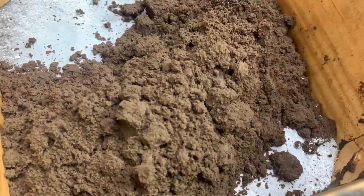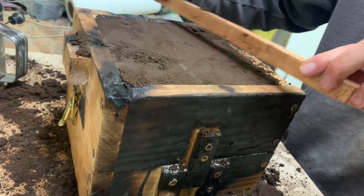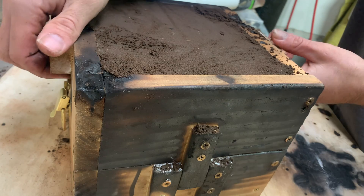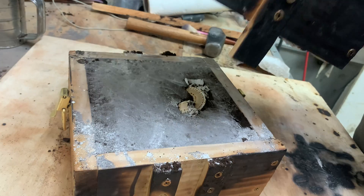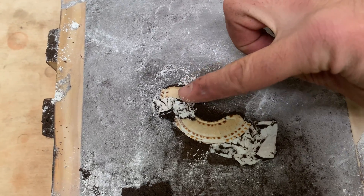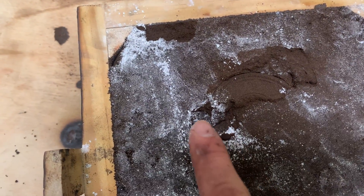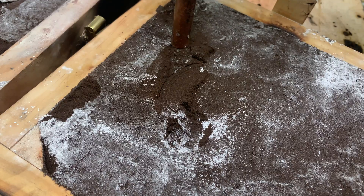Think of it like hydraulics. When you're pouring metal there's a hydraulic pressure effect, so the more pressure you have on top the more it will force the metal down into the small crevices. You can see where the paper towel is — it marks where the metal goes in and out and makes an impression on the other layer, so I know exactly where to carve my channels.